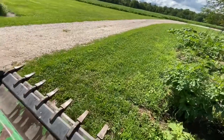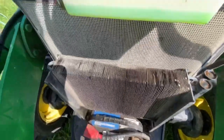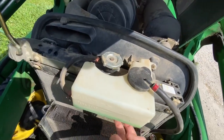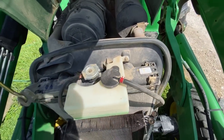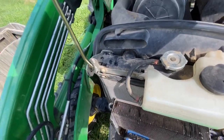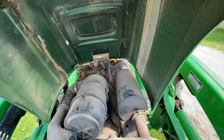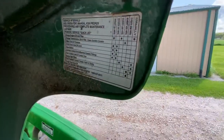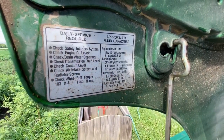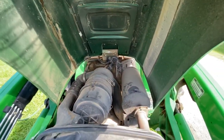Coming up closer to service the machine: there's your battery right down there, the hydro cooler, and the radiator. We need to fill the auxiliary overflow tank for coolant — make sure you clean that overflow screen quite often. Air cleaner and air inlet are up here, muffler, fuel tank is back there. There's also a service interval chart inside the hood, with oil requirements and daily service requirements.